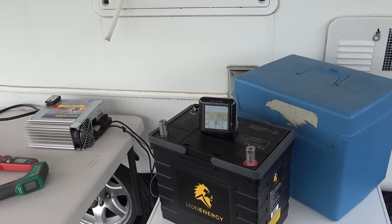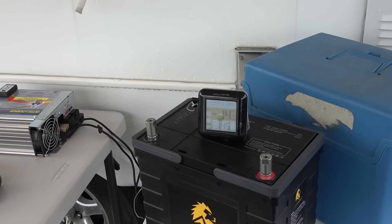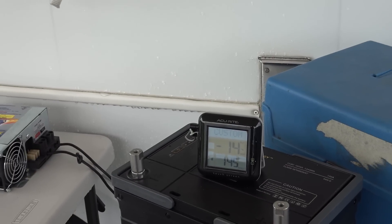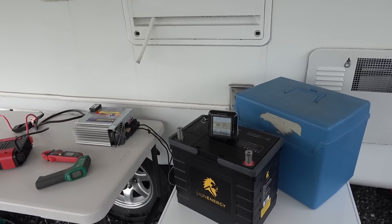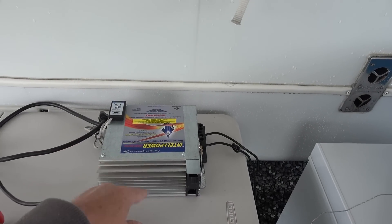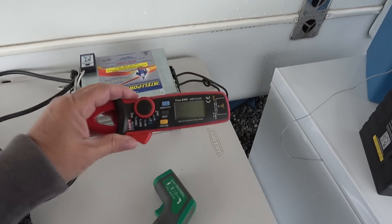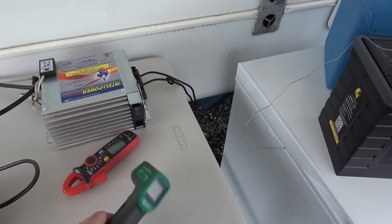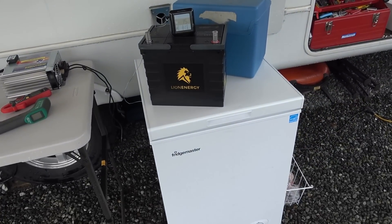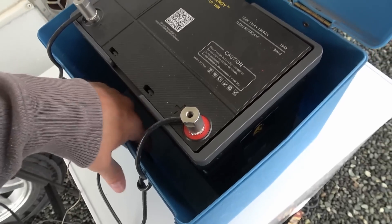They say the cutoff point is around 32°F for charging and minus 4°F for discharging. I'll use an oven thermometer — you can see the freezer right now sitting at minus 15 degrees, and I cranked it up a bit so hopefully we'll get it cold enough for the test to be relevant. For charging I'm going to use my IntelliPower charger, and for the discharge test I'll use a cheap inverter with a load, measuring current with my UNI-T clamp-on meter. I also have an infrared thermometer. I'm going to put the battery in that box and load it into the deep freeze, with the probe taped inside to monitor temperature around the battery.